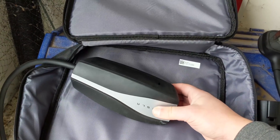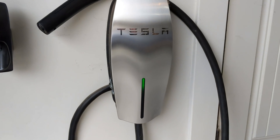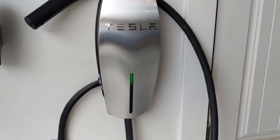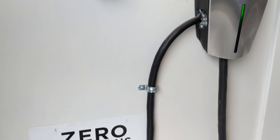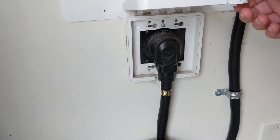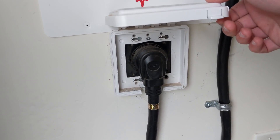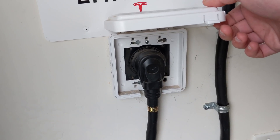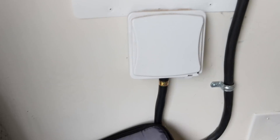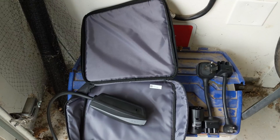The way that you can get the full 48 amps is to use a wall connector. But even then it's not quite that simple. Most people connect their wall connector to a NEMA 14-50 outlet because that's easy to get installed by an electrician. But the NEMA 14-50 outlet can only supply 40 amps, so it will get more than the mobile connector but still not the maximum 48 of the car.